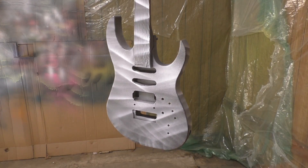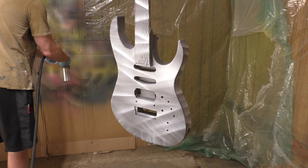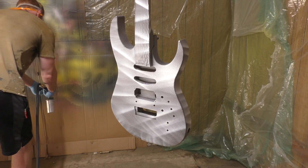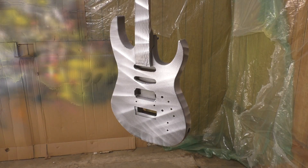These conventional style guns need a more powerful air compressor, but not necessarily for something like this since I'm just doing short bursts. I've got a 3.5 horsepower 20-gallon compressor and it gets the job done with these conventional guns. If I were painting a car with the trigger constantly going, it probably wouldn't be enough. With HVLP you need a smaller compressor, and with low volume low pressure guns you can use something really small. I'm actually interested to see how a low volume low pressure gun works in this situation.